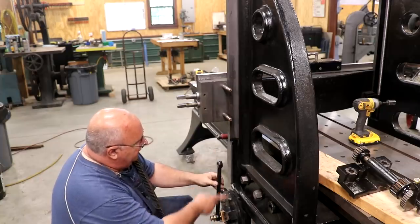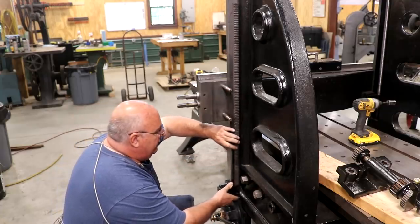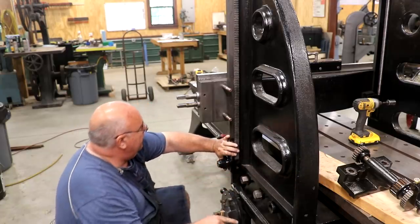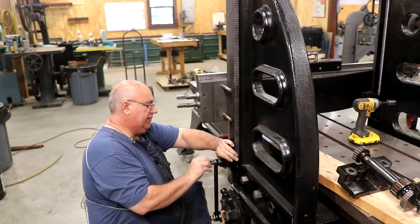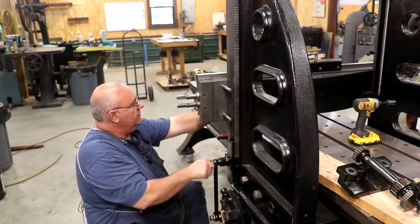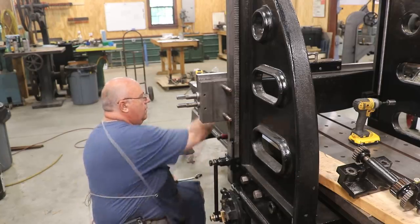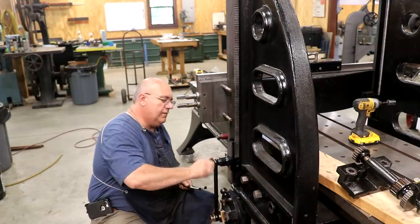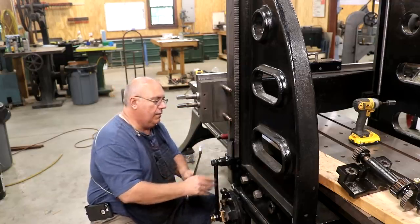This linkage will go up to a rack and move things up and down. When the table goes back and forth this piece will rock — there's a handle on the back where you can adjust how much of a stroke it has, and there are also different pin positions depending on which side you're on, for forward and reverse. Between the handle and which pin position you choose, you can control how much stroke you've got, which determines how far the cross slide moves. This mechanism provides an up-and-down motion that is transferred to a rack that rides on this guide and just moves up and down.